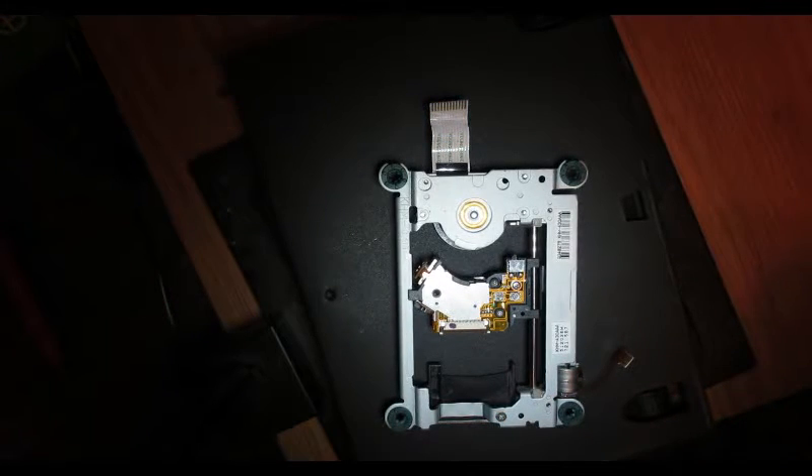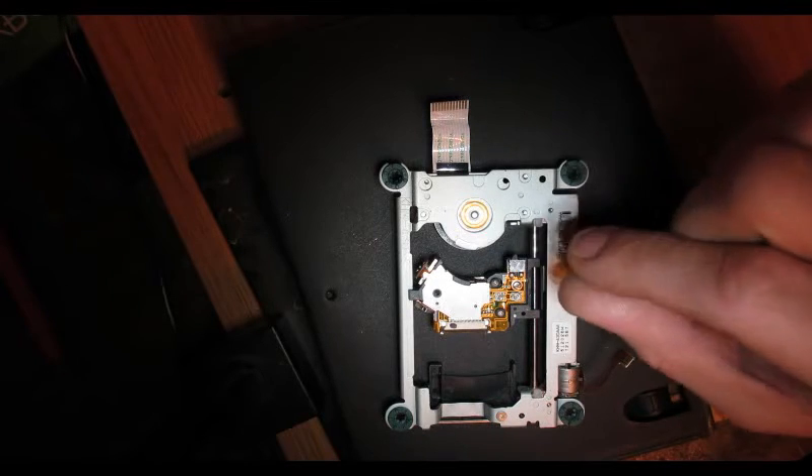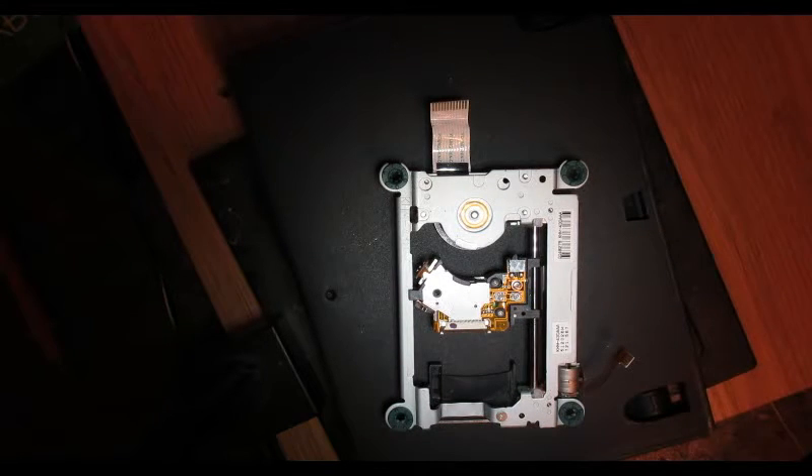So that's really the video — that's how you pot tweak it down. When you put it back together it might be a little bit of trial and error. A lot of yours will not be set that low; they should be set anywhere between 4 and 5.5, usually not above 6. It might take a couple tries. Please don't do it blind — unless you just don't care and know they're five bucks. Just remember, a slight ever-so-slight turn will drop it down a good ohm, so just pay attention.